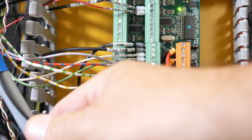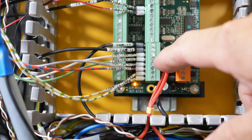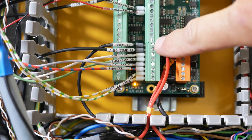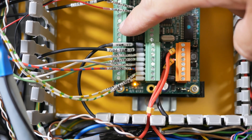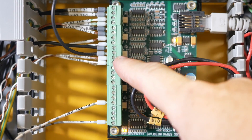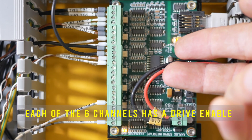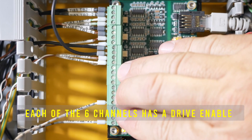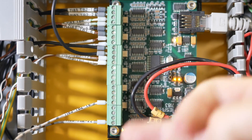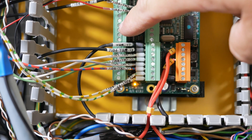I've now connected the other end of this cable coming out of the pneumatic module into my I/O card. Unfortunately, because I'm running two different rails - this one at 24 volt but this one at only 5 volt - I've used up all of my output pins now. I do have a couple of 24 volt pins unused on this board, the 7i83, which is used for analog control of the drivers and motors. I can use those remaining three, but unfortunately I'm going to need more 24 volt output pins than that. I'll probably have to add an extra relay board and then trigger things off my remaining 5 volt outputs.